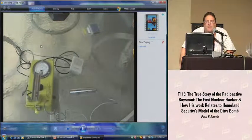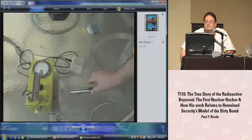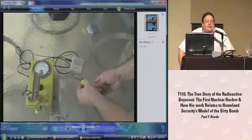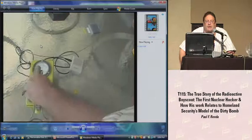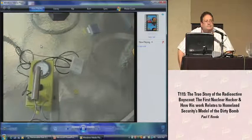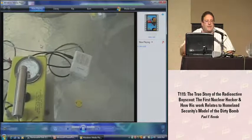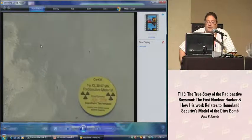The one other thing that's happening is we'll have to turn it down. I'm detecting both the gamma rays from cesium and the beta particles from the cesium with the probe open. One other thing that is hard to notice is that Geiger counters are designed for low-level radiation, and they can saturate. If the radioactive source is that hot, after the needle pins, it could go back and forth or fluctuate. And it doesn't mean that it's safe. It means you should get out of there.